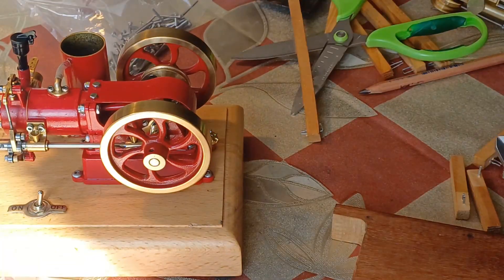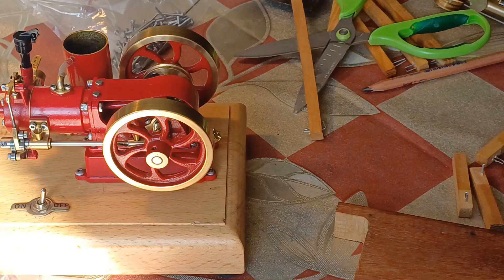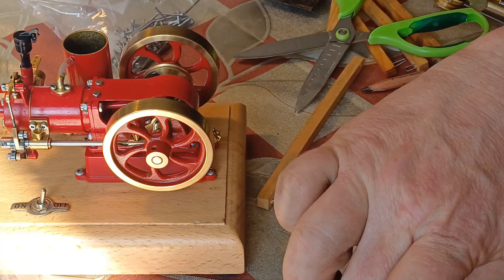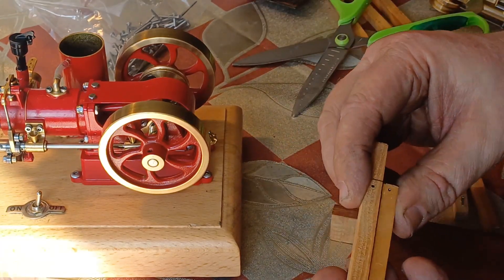These are M2s, 1.87mm. So we need like 1.5mm, probably 2mm in these and 1.5mm or 1.6mm here. So I'm going to cut and drill these.